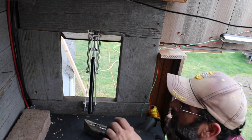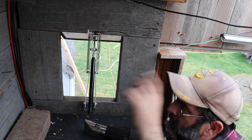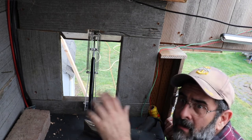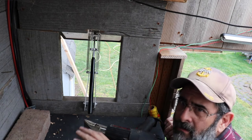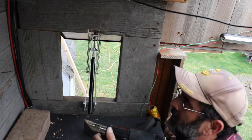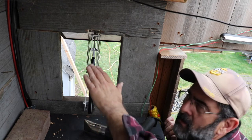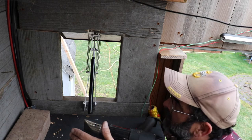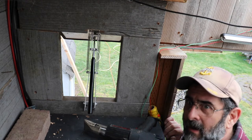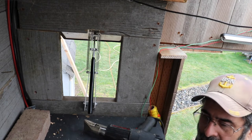Isn't that cool! It takes about 70 degrees before this thing starts expanding — the beeswax in here expands a little bit, and at 80 degrees it goes a little bit faster and just opens right up. It was a good day that turned into a cloudy rainy day — it's raining on me right now. So this thing should cool off pretty good and close again, nice and tight, and it'll be all set for those emergencies when I forget to open up the lower vents to let some cool air into the greenhouse.